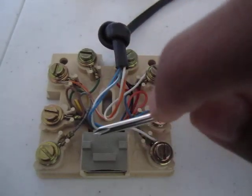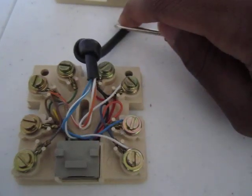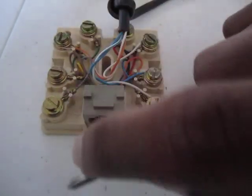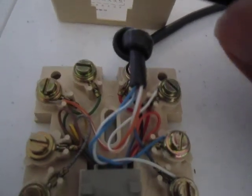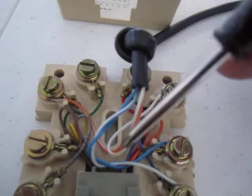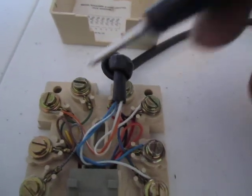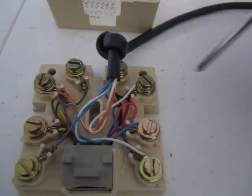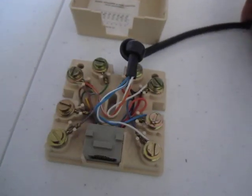So typically in those cases, I'll completely ignore this cord here, and I'll connect the modular cord from the patch panel in here, and then here we have tip and ring. And so in the connection block, you can simply take your hardwired phone with the spade lugs coming out and wire it into tip and ring. And this wouldn't end up getting used at all in that application.